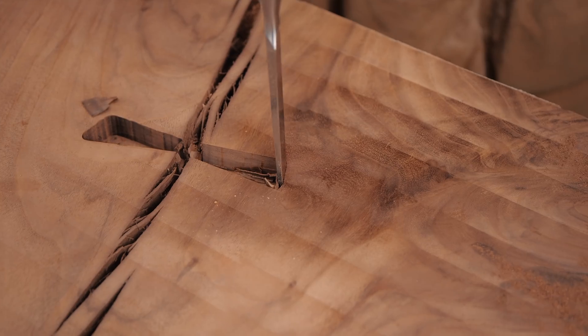Last thing: bevel your bottom edges, which makes it easier to get started. Once you get glue in there, everything starts to expand. If it's so tight now it won't even start, you probably want to shave a little bit more. Don't beat yourself up — the only thing that matters is the top edge. As long as that top edge is super clean and crisp, it doesn't matter what it looks like all the way in there; you'll never x-ray vision through the slab. Just put a little bit of glue — don't go crazy. Save some sawdust from your routing so if you have any gaps you can rub it around the edges before the glue dries. Don't put glue directly on your butterfly key, as that will cause it to swell before you get it in.